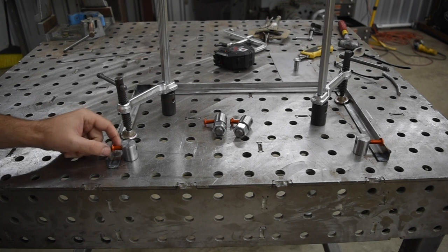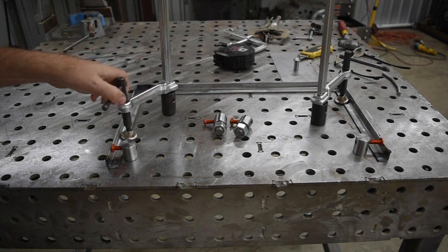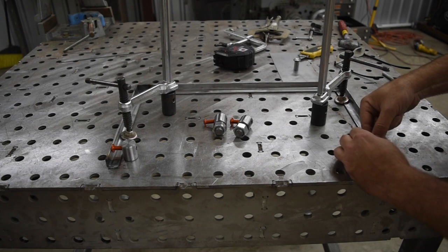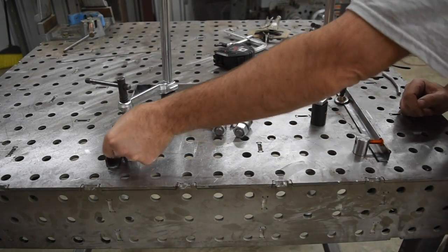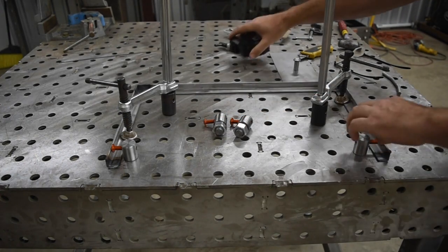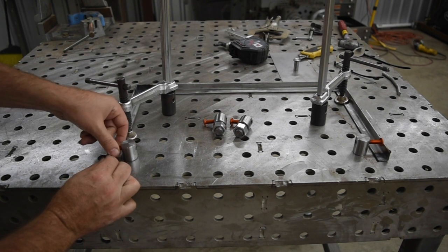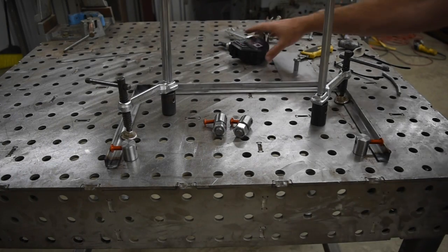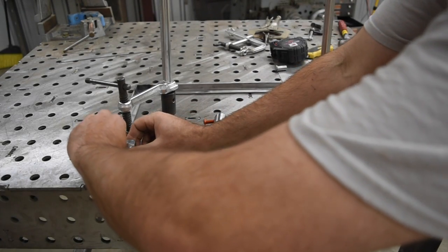Get one on the other side. I'm going to use some different bolts than these — I just used these for the video to make it a little more interesting, the contrast and color there. Sometimes if you use colored stuff in your videos, people watch them more. So now you can see we got this adjusted out here. And even though this has already been welded, we can use those to push this out to the correct position. We've already moved it out some. I'll move this one out some more. This is something you can play around with and you might actually have to move it out a little over. Pardon my reach across the camera.